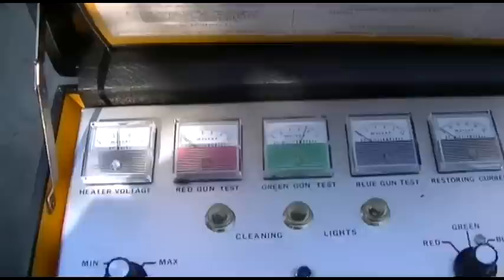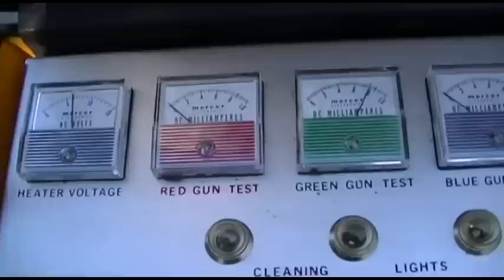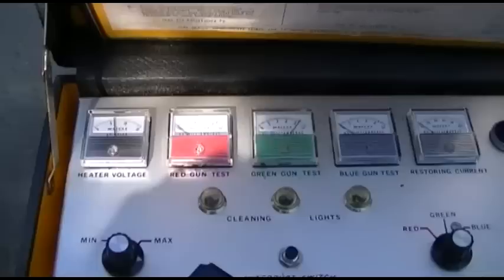There's a date on the deflection yoke. It says August 12th, 1949. And this is a metal bell, metal CRT that actually tests good. Look at that. 800 microamps and climbing. Well, this CRT surprisingly checks excellent. Let's see, what is this? Is this an RCA input for what, a phonograph or what?